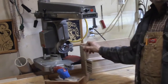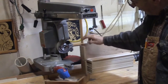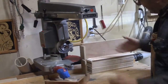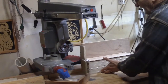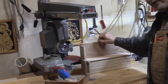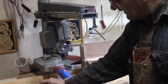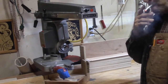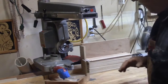I also made the ends — instead of quarter or eighth inch plywood like I had before, which was kind of floppy — I made them out of half inch, which makes them a lot stiffer. They stay at 90 degrees to it much better. So overall it's just a simpler, easier jig to make, with the added advantage of being able to do taller boards.